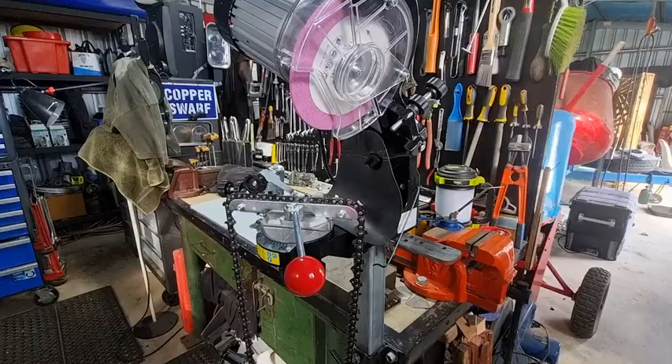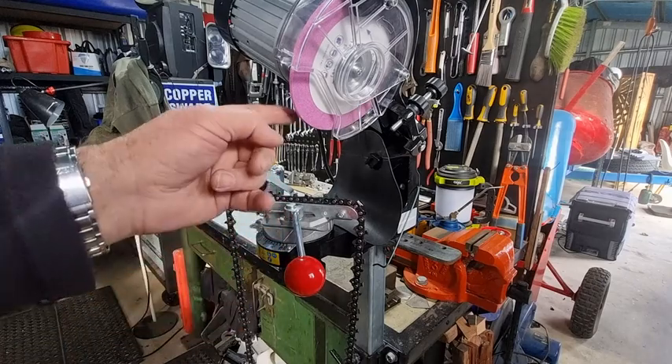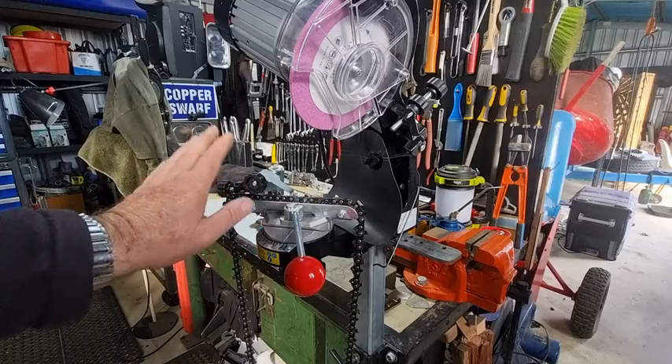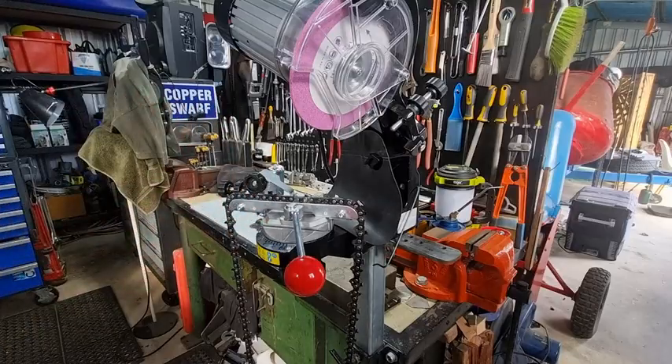You'll set your backstop up so that when you pull your grinding wheel down, the grinding wheel just touches the tooth — that's your starting point. You'll start the grinder and look at the tooth. Because you have it set up so that it just kisses the wheel, most likely you'll have to give it a little bit of an adjustment before you take off the right amount of the tooth. Normally that should be set at 30 degrees for the top plate and 60 degrees for the side. If you need to take a little bit more, take a little bit more. Because that was the average tooth, you should not have to readjust this. You should not have to touch it — moving it in, out, in, out is where a lot of errors come.